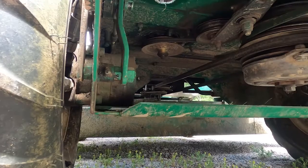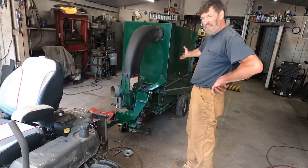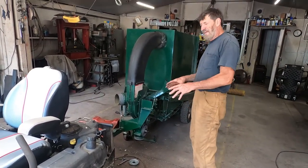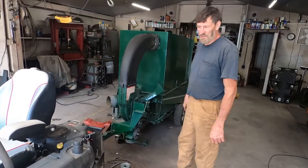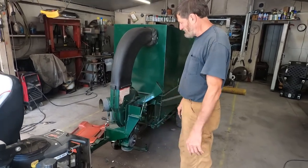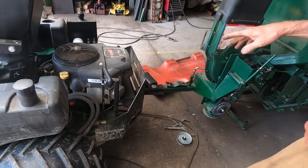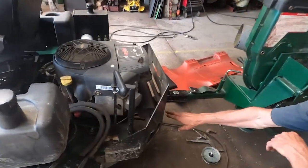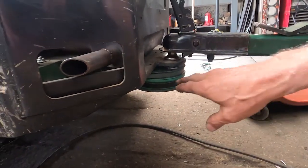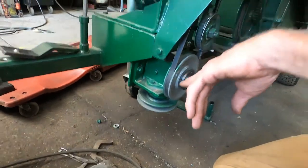That's all pretty simple. Today we're looking at a machine that I built here. This is a vac-all unit for sucking up grass and leaves and yard debris, and I made it run off of my zero-turn mower that's been modified. So I have one engine that drives everything. It runs this blower system here. I had it set up where there's a power takeoff that I rigged up on the back of this zero-turn, and the way I had it before, a belt ran all the way back around a bunch of pulleys and up around this blower shaft.